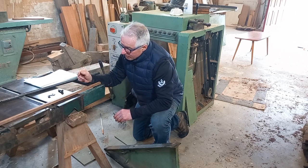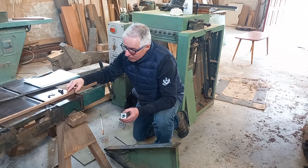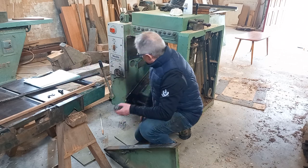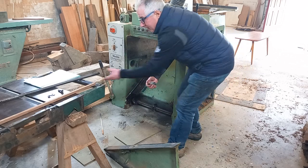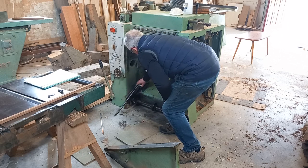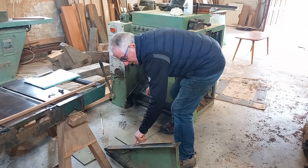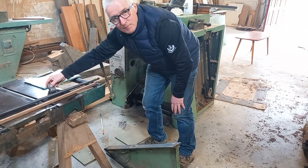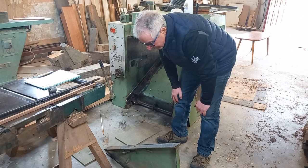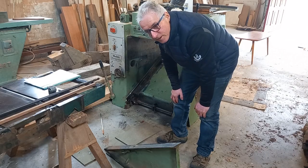That's a little job I'll test out while I'm in the downtime - check for any corrosion, any marks, just make sure everything is okay. It doesn't look like much adjustment is needed, but now is the time to do it. I can pop the rollers out here - that's why I took the table out. As you can see the machine is totally stripped down; the acme bars would normally be in here with the carrier on it, going up and down through this socket. I have an engineer fitter-turner doing the new parts, and when they're back in we'll line up the table with the blades to make sure we have 100% accuracy.